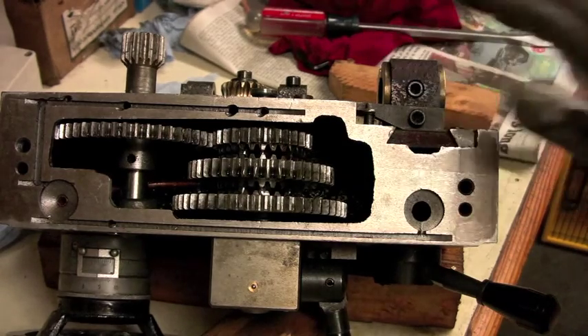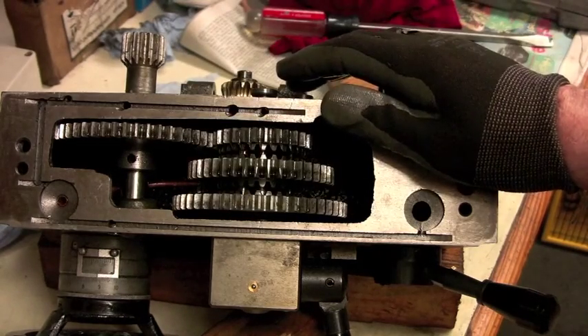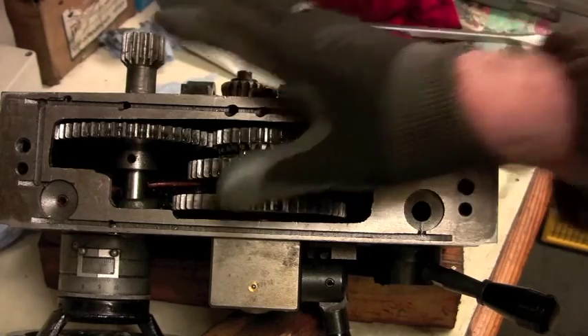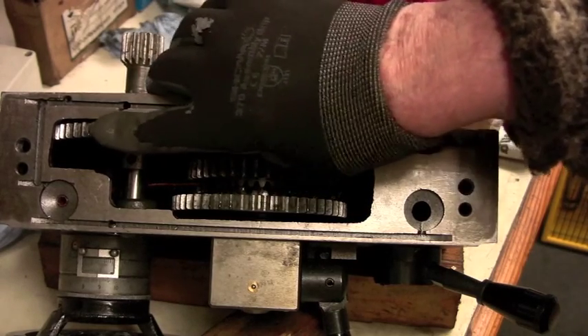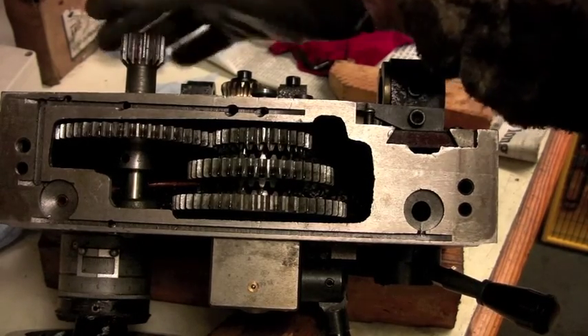Now for the internal gears. The Grizzly manual describes the function of these three as clutch gears, but I would describe them as dog gears, as you will see. This large diameter gear is permanently in mesh with the small diameter spur gear that is pinned to the cross slide lead screw. This rear-most gear is permanently in mesh with the transmission gear, and it in turn is connected to the hand wheel and to the gear shaft, which is permanently engaged with the rack.